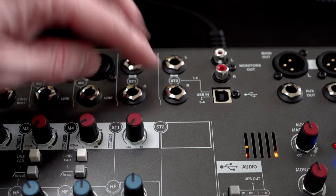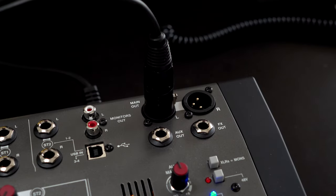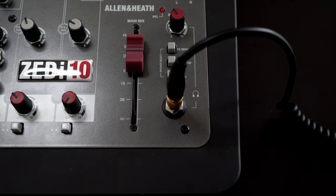If you want to bring in a soundboard with music and record in real time, you can bring in two different channels of stereo audio. Or for a mix minus, you can bring in your mono source on that channel. You have two XLR connections for connecting professional monitors. There is only one headphone output, so you'd want to get a headphone amplifier if you're going to have multiple people in studio — that way everyone gets control of their own monitoring volume.